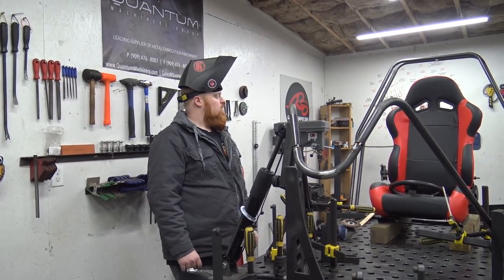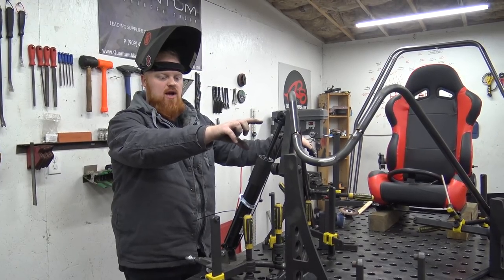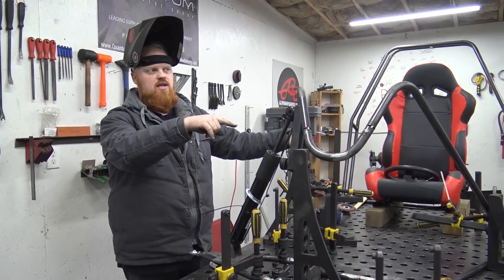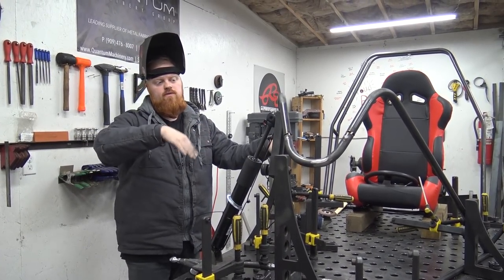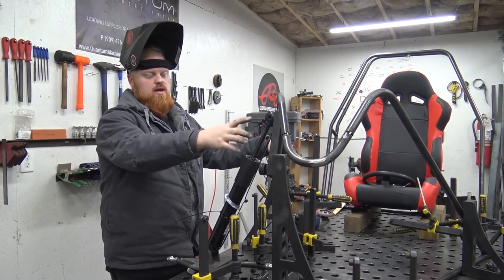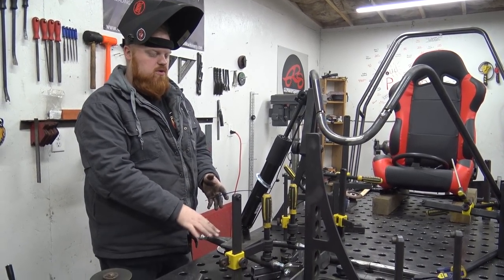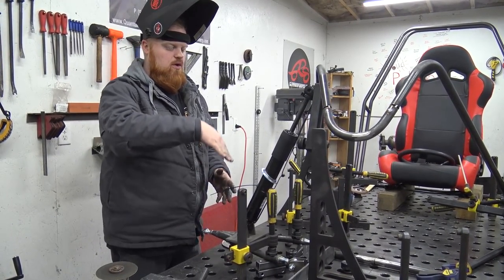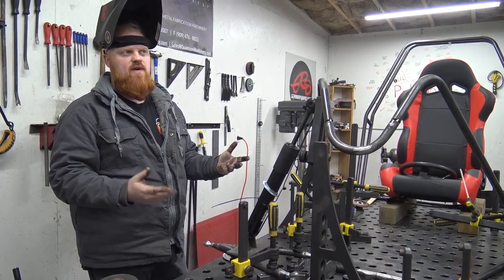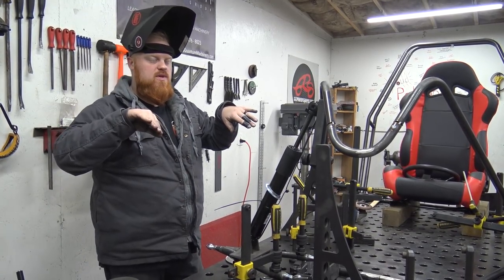So we've been working along on this old buggy. We got our shocks at half travel, so when our A-arms are flat, that'll be half travel. These shocks have 10 inches and 10 and a quarter of suspension travel, so we got them squatted down to 5 inches by using zip ties. So we can see where our lower A-arms are going to be at flat travel, so that'll allow it to go even higher up, because our tires are going to be like 25s or 28s on the front, so we'll have plenty of ground clearance at full suspension squat.